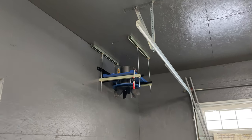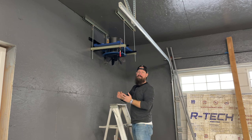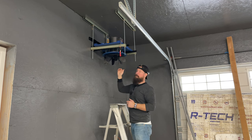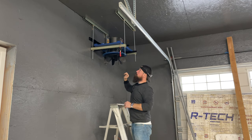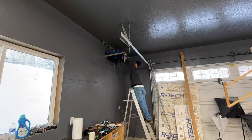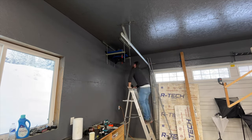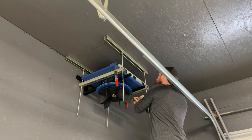The trapeze is all built, so now I just got to raise it up about eight inches. I'm going to try to go as high as I can and leave about an inch and a half to two inches between the lid of the shop and the top of the motor. The lower unistrut rails are supporting the blue motor bracket, so I'll start on the front side, push it up a few inches, run the nuts up on the lower unistrut to hold that in place, then go to the back and do the same, back and forth until I reach the appropriate height.